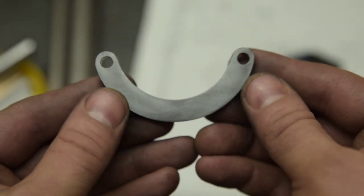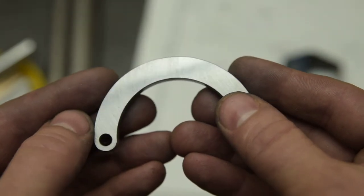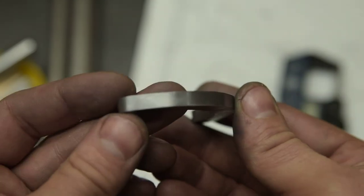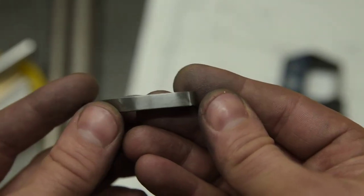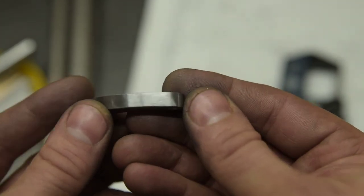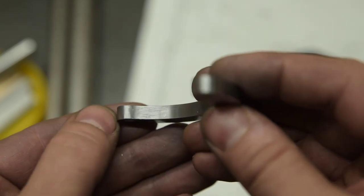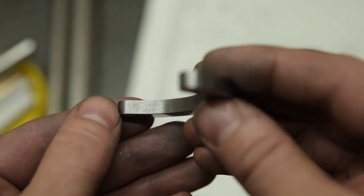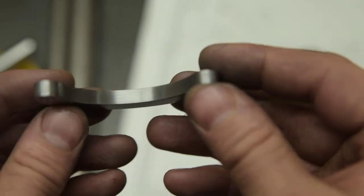That's the face that I hit with wet and dry, and that's the one straight off the mill. That's the draw-filed and wet-and-dried edge. You can see on the reflection there's something there that needs to be looked at again, but that's fine. I'll work on that later.